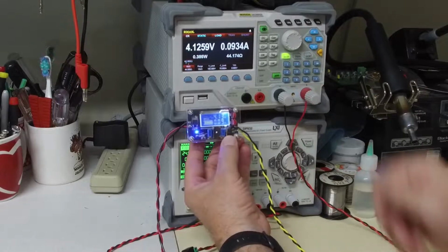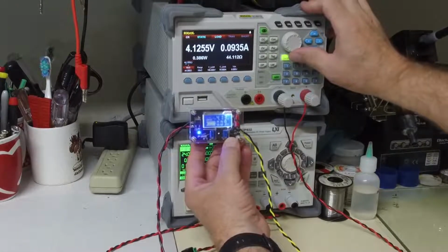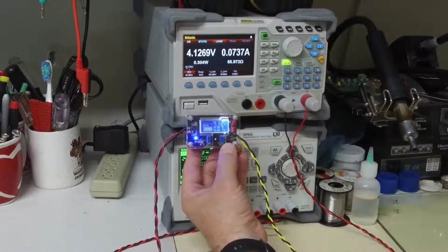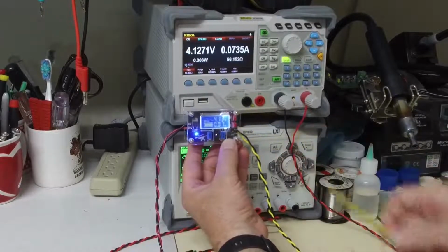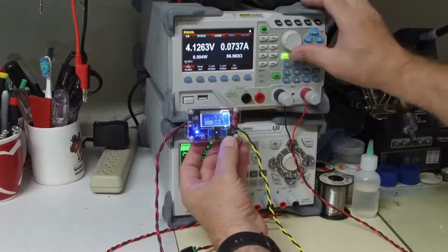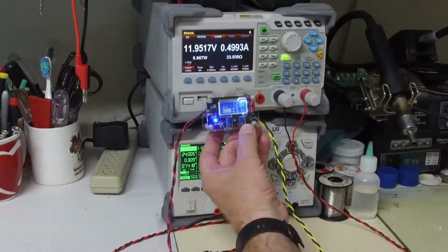And so if we left this attached and unattended, it's going to keep on putting power into that battery, which is not a good thing. The battery is still attached, and maybe the battery specification says that it should only be in this state for maybe 30 minutes or 60 minutes, but this has no way to terminate this, so it's just going to keep on charging forever, which is going to be bad for the battery. What else can we show?